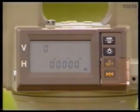And the display then settles with the horizontal circle reading 0 degrees, 0 minutes, 0 seconds, and the vertical circle displaying a single 0. This indicates that the horizontal circle is ready, but the vertical circle is waiting for you to activate its preset graduations. This process is known as indexing.